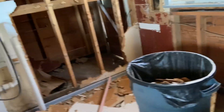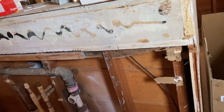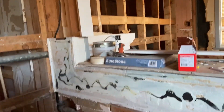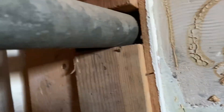I'm not entirely certain of the layout of this house. I don't know why this area would have been separate. I do know that they went through a load-bearing stud and cut out most of it to put that pipe in — you're not supposed to do that. Here's another one they cut completely in half. Though it looks like there's another one behind it, so maybe that's okay — unless they cut that one too.